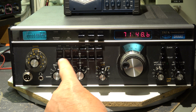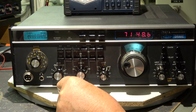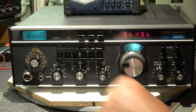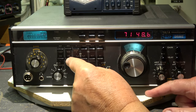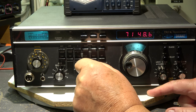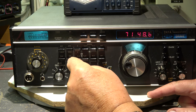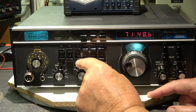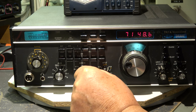One weird behavior: when I switch on the noise blanker the display disappears and the passband tuning is activated. When I switch off, the transmit relay also acts when I press the noise blanker. Strange. I don't know which filters are installed — we'll check the transmit path now.